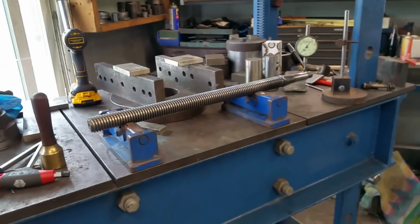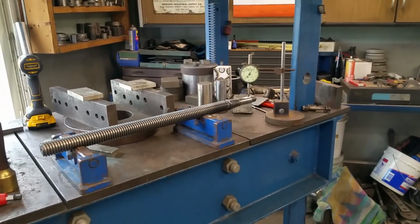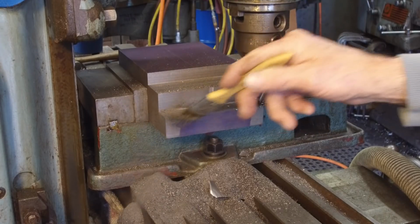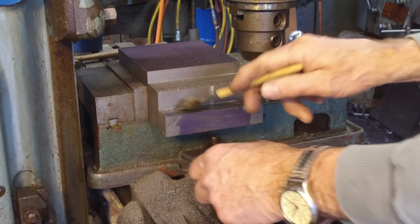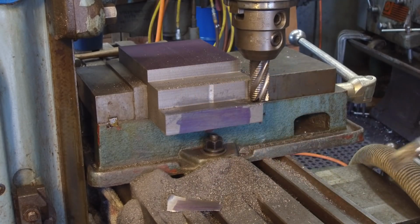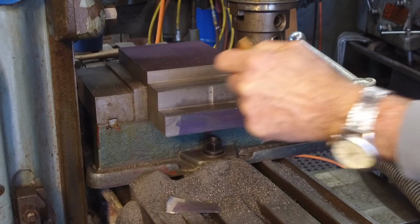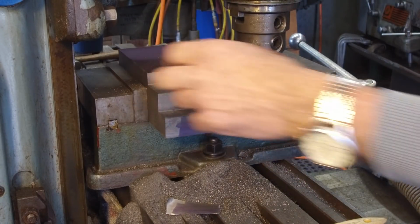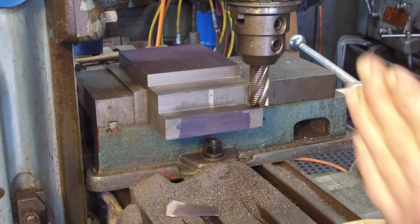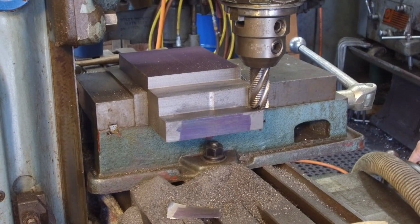So we didn't really need to make a video on how we straighten that, but there's a little sample of it. We just came across on a cut here. We were in a little bit deeper and it was peeling out a piece, and then I brought it out just a little bit right there. And we're gonna take another full width of the cutter again, and then just a partial. And then we're gonna start making our down the center runs here.